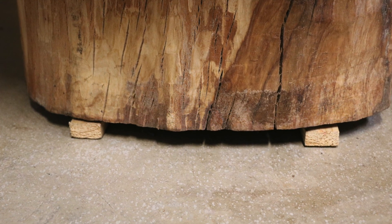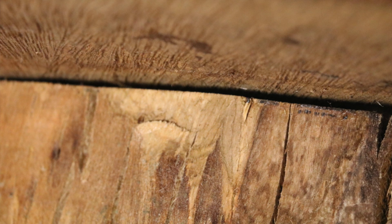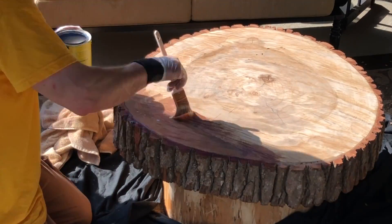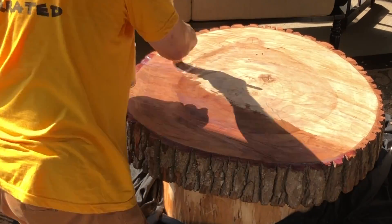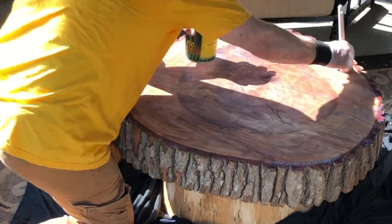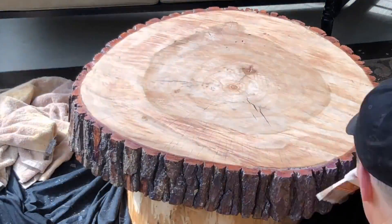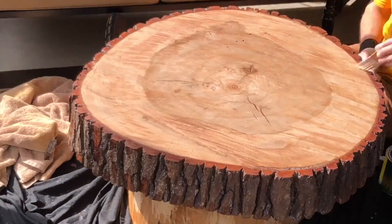I put the base up on a couple of scraps of wood. The top slab did not match perfectly with the base, so these air gaps give a place for the end grain moisture to escape. I coated the top slab with three coats of outdoor oil, which protects against UV damage but more importantly prevents mildew. The top slab had been drying for three years, so I wasn't worried about cracking or moisture.